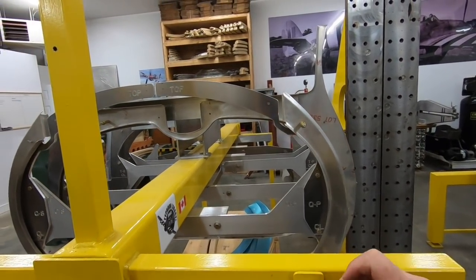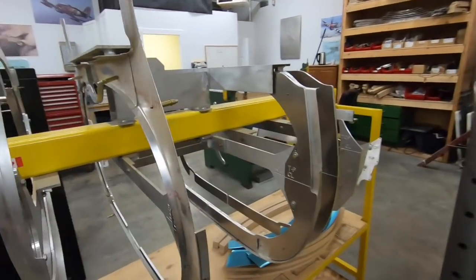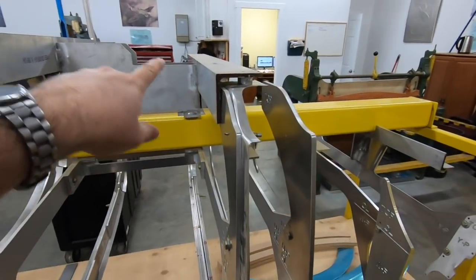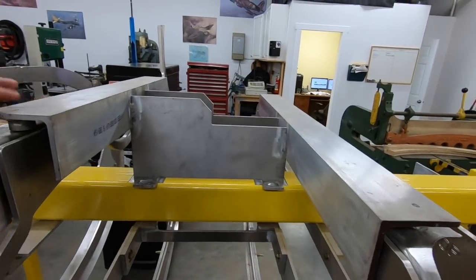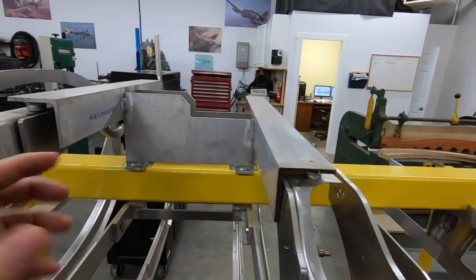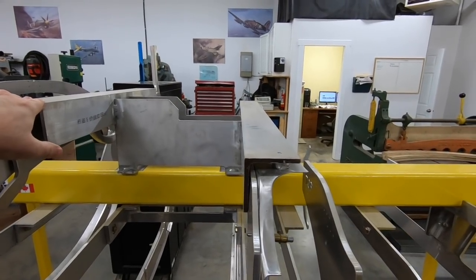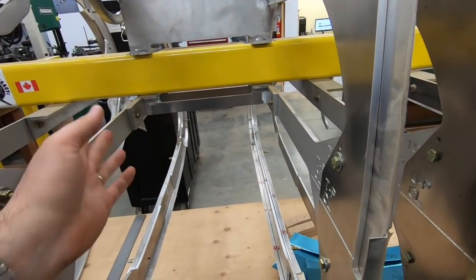It does have a little bit of a difference from the monocoque in that this one was just designed with a bit of welding involved. So there's a couple main brackets, the upper one here, which gives us our bolt locations to attach the radiator fairing to the forward structure of the Typhoon, and a lower assembly that spaces out correctly.